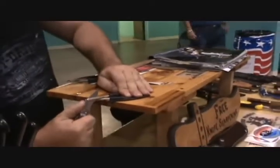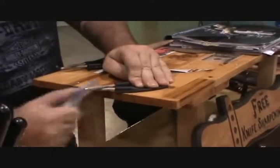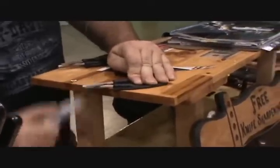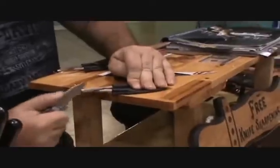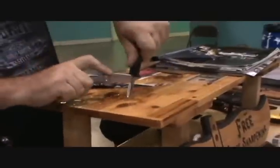On the edge of the counter, spring it in there tight, snap her through. These ain't made to tear steel or change the angle. They reline the blade, taking it back to its original cutting edge. As you get sharp, lighten up on them. For the serrated, go in the middle.